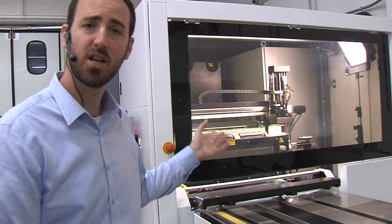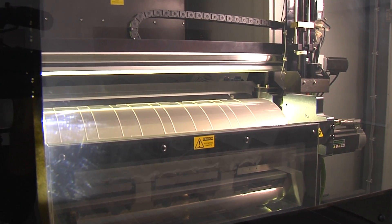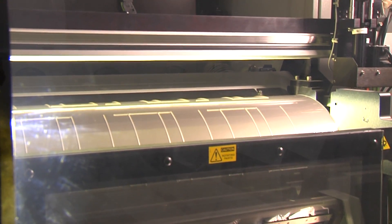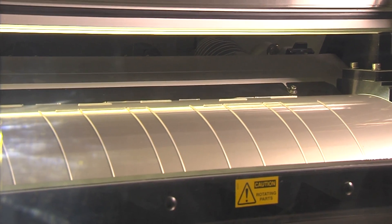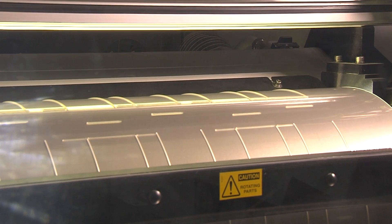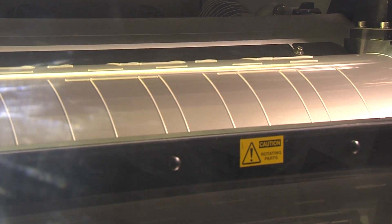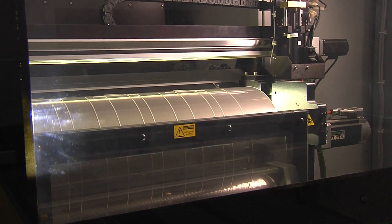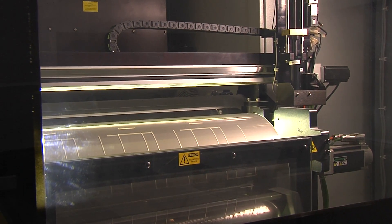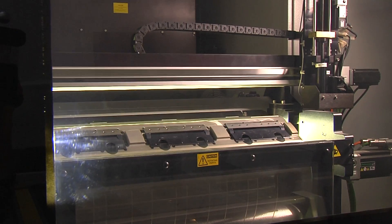Writing is completed, and the last stage is curing the rules. What happens now is that the polymer turns into something more tacky, into a solid, sturdy rule that can actually give the impression and create the creasing on the substrate. This process is the last in the entire preparation of the job on a Euclid machine. After this, we can start going directly into production and using the laser cutting. We wanted to show you the flexibility of this machine. We prepared a creasing rule, but you can make changes on the fly. A lot of the advantages of having a digital solution for the finishing side is that even when a job is on the machine and you want to make some correction, adjustment, or decoration, you can do it on the fly — when the customer is present, when the customer sends you an email with a new job, or even via your web system.